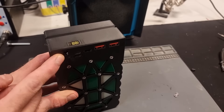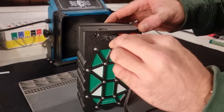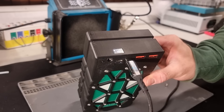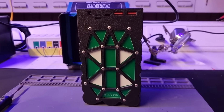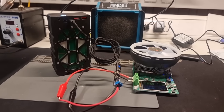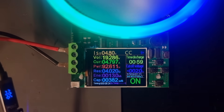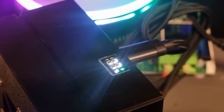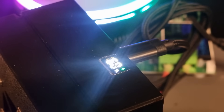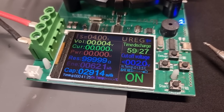The unit doesn't work straight away because it only activates after the first charge — so I plug in a USB-C cable and there we go. It'll likely take a few charge cycles for the full capacity to be available. I've got a programmable load to measure the final capacity. I'm able to draw about 92 watts from it, which is pretty cutting edge, and after discharging it for a while it looks like we have a capacity of 62 watt hours — I'm actually really impressed with that.